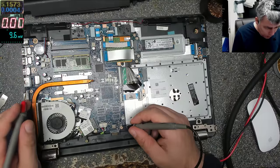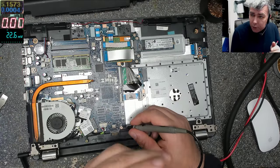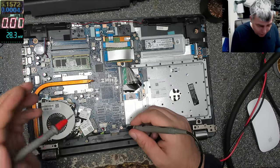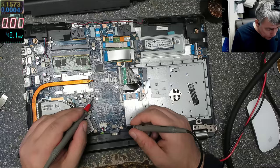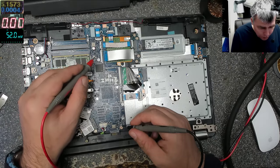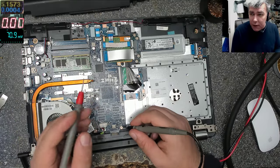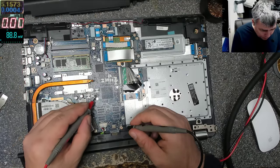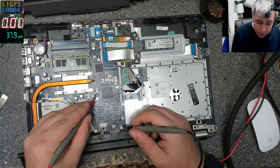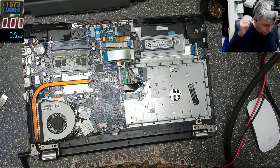Here is nothing. This is a new one. So I can't tell you the path, like what we spoke before, like two MOSFETs and a coil. This is different because you have chips, you don't have MOSFETs anymore, so probably the MOSFETs are inside the driver chip. So this is a new one, but even on this one you should have 19 on the main power rail.